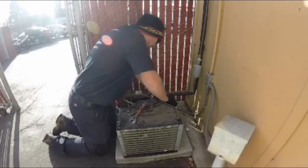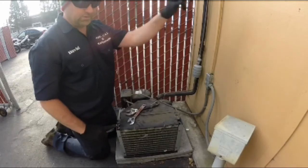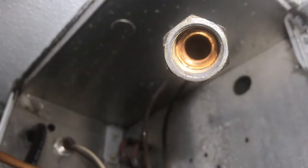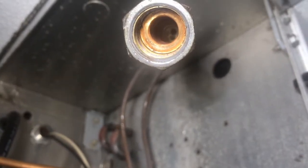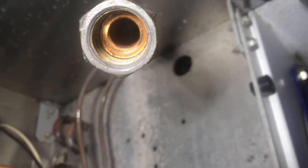We're going to pump this thing down — close the liquid line and pump all the refrigerant back into the receiver and condenser so we can work inside at the evaporator coil. Here's how I found the coil the other night — I noticed two bags hanging in the coil with the nozzles. I'll go ahead and pull those back down, then open up the flare from the TXV and take a look inside the distributor to see if there's a nozzle in there. Moment of truth — there's no nozzle in there, just the distributor. You can see the two holes for the distributor in there.